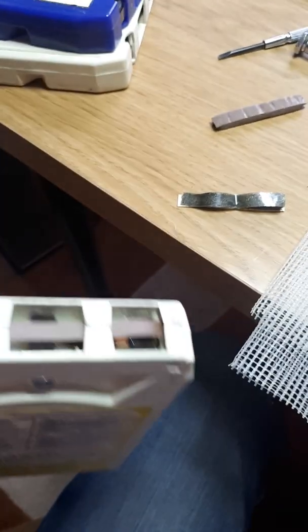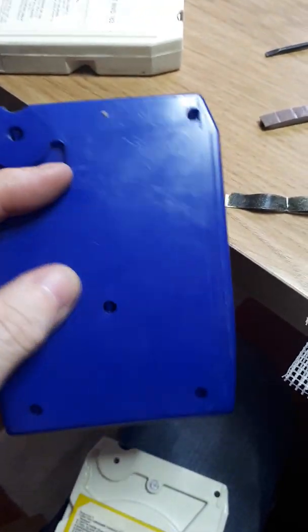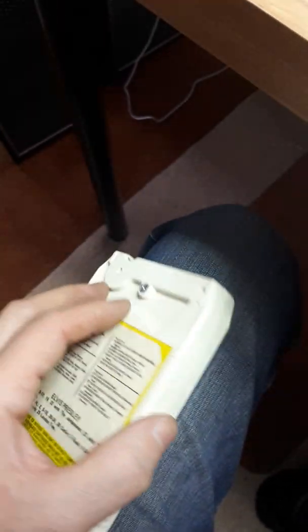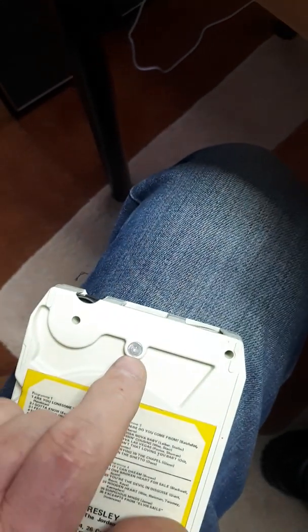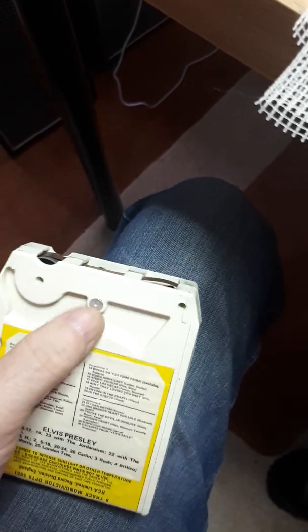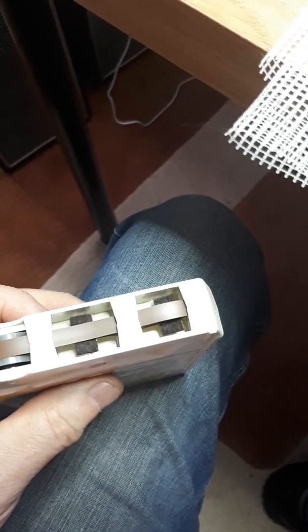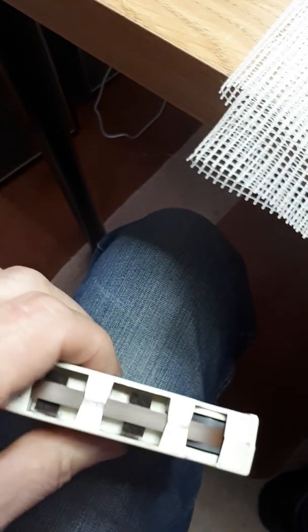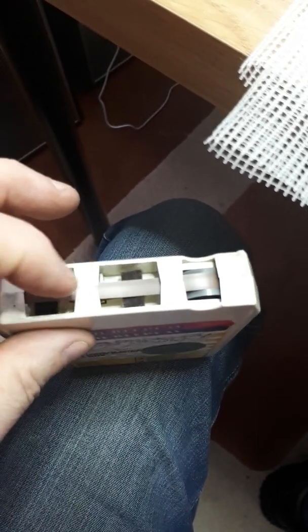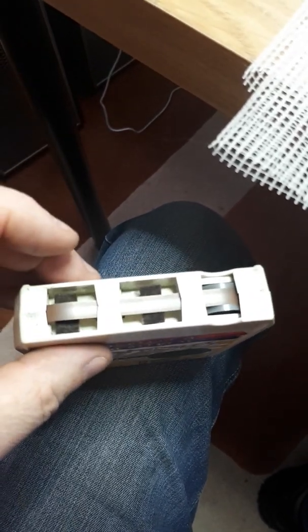Now then, also, you've noticed that a lot of the tapes come with flanges. That was the bulk of how the majority of them came. But some came, like this Elvis one, RCA, came with a rivet, and it's nigh on impossible to split the tape unless you drill that out. And I've never done one of these. So there again, go back to what I said before. Check your sensing foil is in good shape, because that's where it's likely to break. And check these pads are also in good shape too, because you'll get no sound out if they aren't.